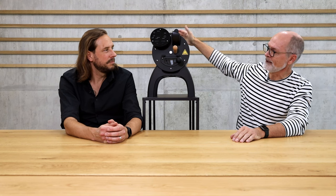First of all, the temperature. If you're not very far away from the Bullet, you will have pretty high temperatures going even through the ventilator. So those blades will actually have to take that temperature. And right out of the Bullet, you will have 180, maybe even more, degrees Celsius. So it better be metal. But even some plastic venting systems can actually take pretty high temperatures. But you will have to find that out with the particular venting you're looking for.